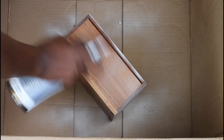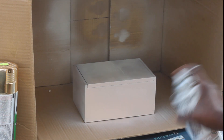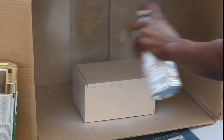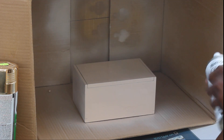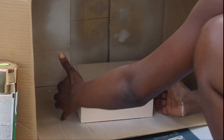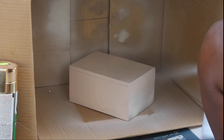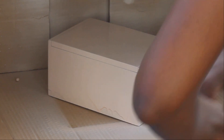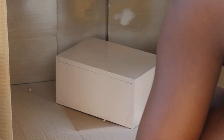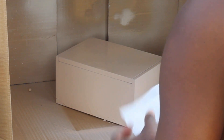Once primed, I moved on to paint — a blush pink matte chalk finish from Rust-Oleum. But then disaster struck: the paint started to run. There's that moment in a DIY project when you realize you're ruining it. If this ever happens where you over-spray, you can use a piece of tissue and gently dab where the paint is running. Once you dab it away, let the paint dry and then sand the surface down to get it smooth, then repaint.